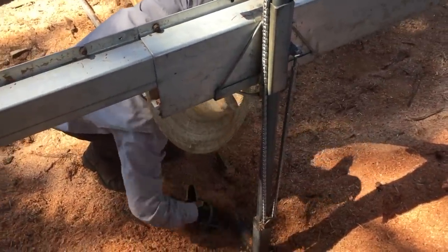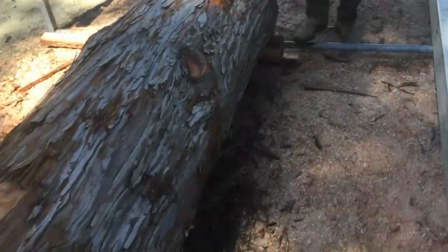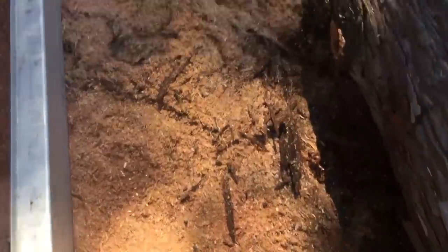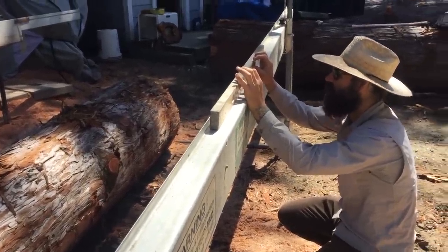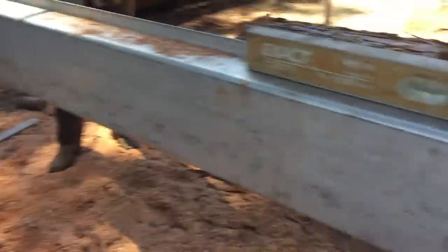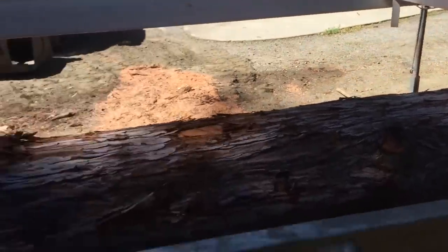Setting up the mill doesn't take that long, but it's usually half an hour to an hour depending upon the terrain, and I just happen to be on some pretty unlevel terrain. When you have to put risers up underneath to bring one end up, try to avoid having stuff sticking out where you're going to trip — try to keep your walk zone clear, because you're going to be building up periodically and need to pull out some of the sawdust. The other side's not quite level, so I've got to bring this side up just a little bit. Lift it up and we'll see if we can get both sides level so the mill runs parallel and isn't dipping down.